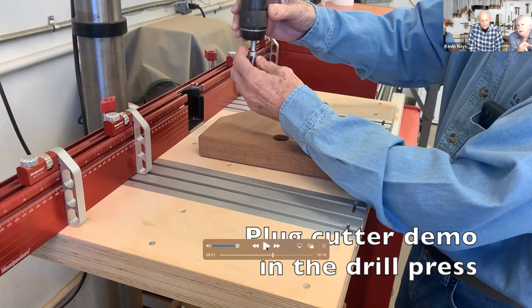I did have a video about what torque is. You saw Ed pointing at the drill motor, the 1 and then the dot and the 3. That is a torque setting of 2. It limits the amount of twist that the drill will put into the screw. A 2 is nothing. A 2 you could probably do with a screwdriver and your hands. A 10 is the torque I was using driving those big screws, probably 100 foot pounds of torque, or ability to twist. Which is why the higher settings will just break the kind of screws, because there's too much force for them.